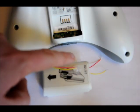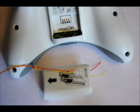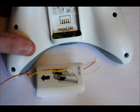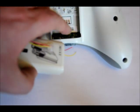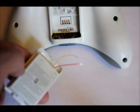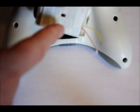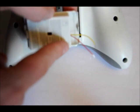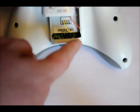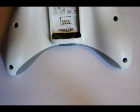So what I've done is drill a little hole and placed my yellow ground wire and my positive wire through it, giving off maybe an inch to inch and a half of wire for the internal wiring. I'll be soldering it to the two battery leads and then closing it up. In this case, my yellow is my ground and my red is my positive. If you look at the battery symbols — that's negative, that's positive — so your positive is on the left and your negative is on the right. So I'm going to solder my yellow wire to the right and my red wire to the left, then close it up.